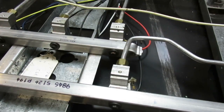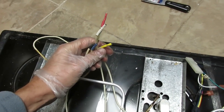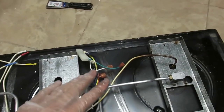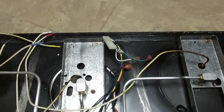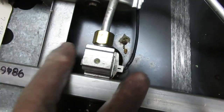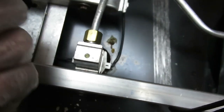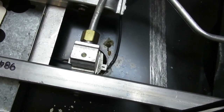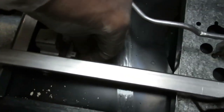As you can probably see, there's a mess of wires over here that I've disconnected. All these wires are the ignition or igniter wires. I'll show you the actual igniter box that's attached to the cover that goes over the top of this. I disconnected everything and took a picture before disconnecting — that's probably the best way to do it, just to make sure you don't mess something up later during reassembly. Each one of these valves has a couple wires going into it — that's a sensor or switch that, whenever you start turning the knob, sends a signal to the igniter box to make sure the spark is fired off to get the flame on.